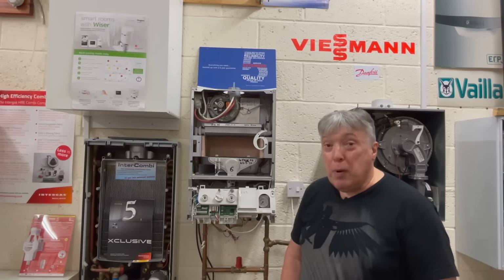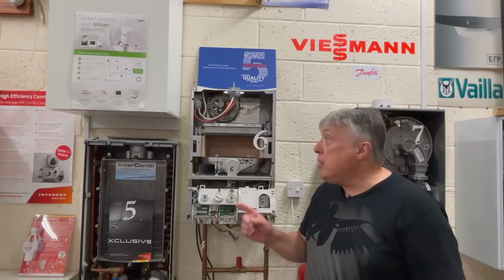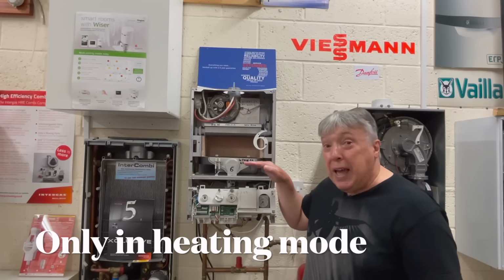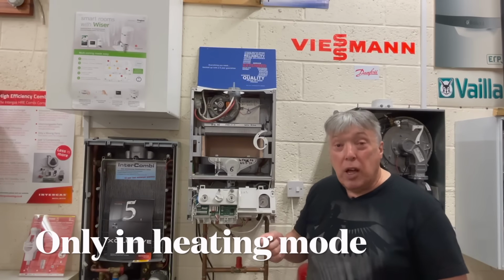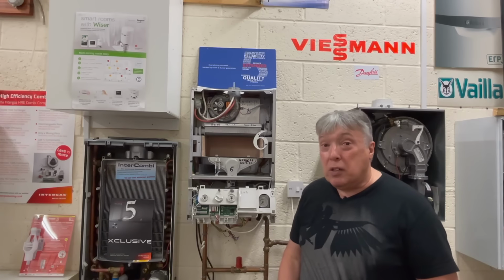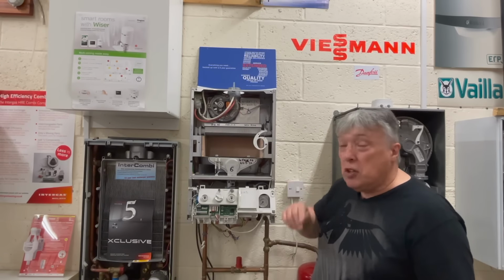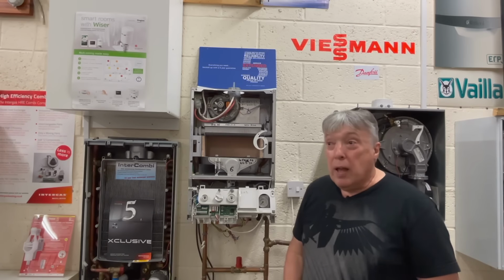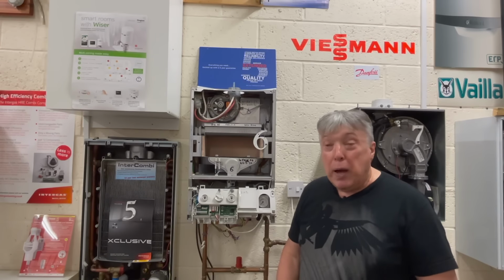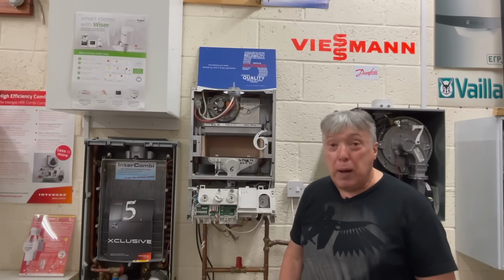A few boilers, the manufacturer thinks about the consumption of the amount of gas that this uses. And where the two-speed fan comes into play is that there's a time delay of up to 3 minutes on low gas. So the fan would obviously have to run at slow speed. This particular one is around 19 seconds, and then over the next minute, it slowly increases the gas flame until it reaches a point where the sensors in the top send the fan into full speed. And that saves an awful lot of money, especially for people on LPG who pay their bills in gold bars. That's why this is one of the best boilers that's ever been built.